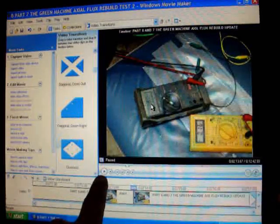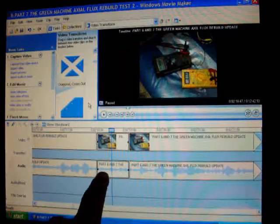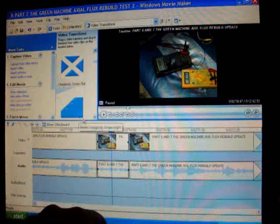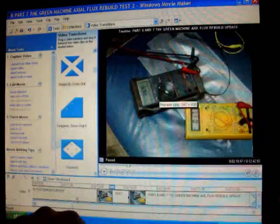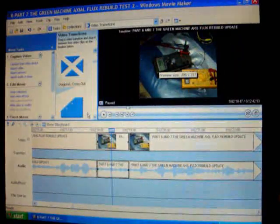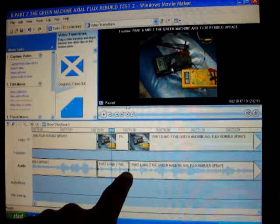I have 29.8 volts, so that's staying pretty consistent. Looking at another section — I got six humps between two minutes 18 seconds and two minutes 19 seconds. Checking the voltage reading on the meter, I'm looking at 36.9 volts — about 37 volts. Six beats per second times 60 is 360 RPMs. At 36.9 volts, that's not very far off. It's doing a little bit of plus. So 10 RPM per volt.